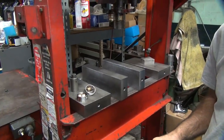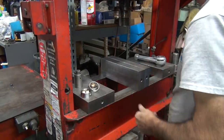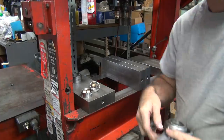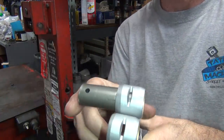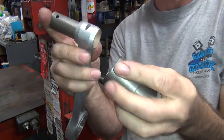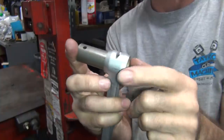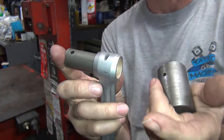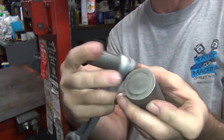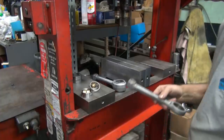Alright, so we're going to press these in and out right here. We'll do the pin bushing first. This has a recess that goes into here, a counterbore, so that goes through like that. Then you press into this tube right here. This is taper cut, so it's universal alignment. It grabs against the taper and pushes in. It's made for 74-inch rods. 80-inch rods and later 74s come straight out of their own machines, so it only hits on the outside edge when you do it that way. When I push them back in, I just flip around and push against the flat surface. Push it in with the press against that, and you're done. Straightforward.